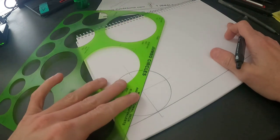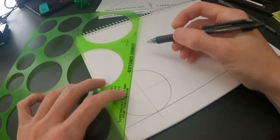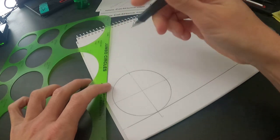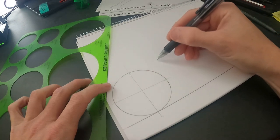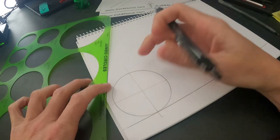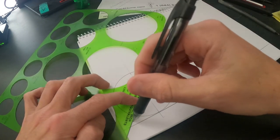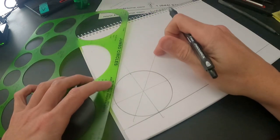On my frames, I like my head tubes to be below the top of the wheel. If you were to run a line from the top of the wheel straight down, it'll usually go into the center of my head tube — depending on the wheel size, like a 29-inch, sometimes that's above your head tube. That's kind of how I figure out my angle, so I like to just run the template and mark that angle.